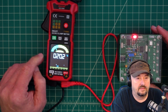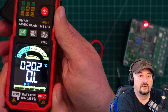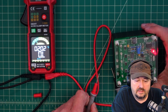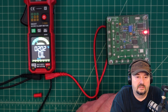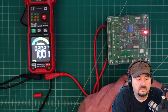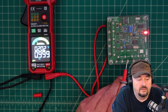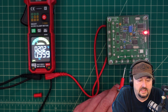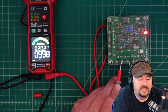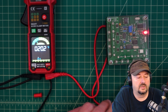Let's move over to ohms or resistance. We've now moved over to ohms. This should be 100 ohms — and we have 100.1. This should be 1,000 ohms or 1 kilohm — we have 0.999, which matches the calibration sheet. This should be 10k — we get 9.98. And 100k gives us 99.8. We're happy there.